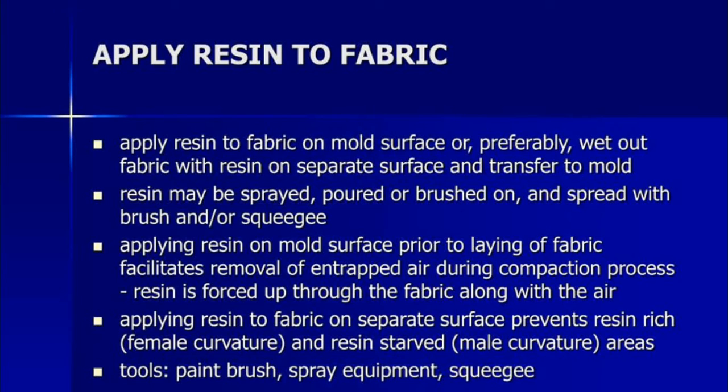And that is PVA mold release agent. PVA is a water and alcohol based release agent. PVA means polyvinyl alcohol, so basically it's an alcohol based release agent. After applying wax, we can apply this agent to easily remove the composite material from the mold. It allows easy release of the part from a mold.